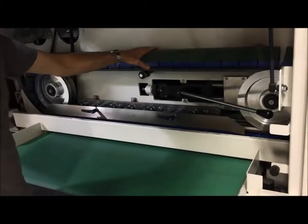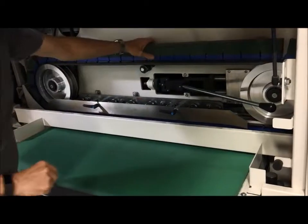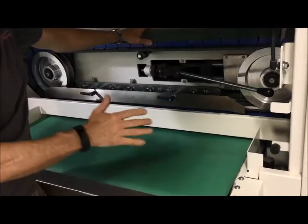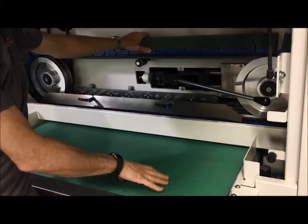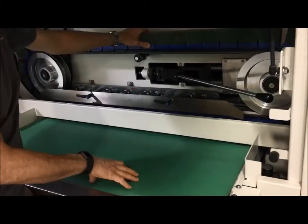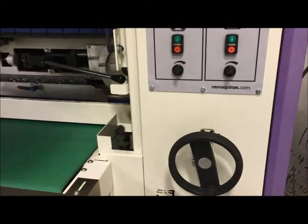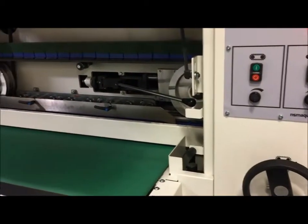And that cross belt, other than the rotor machine, pushes the part down instead of trying to pick it up. And that is why we can, with a high friction belt, hold a very small part on this machine. And other than that, it is still a brushing process, which is fairly forgiving. You don't need to adjust it very precisely.